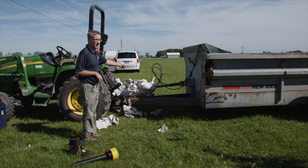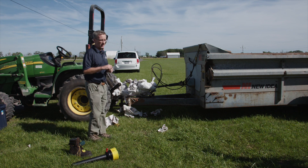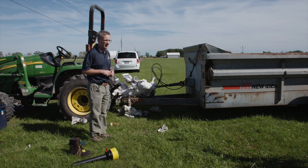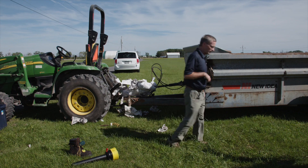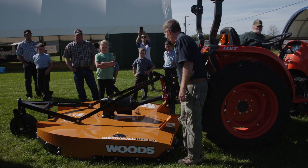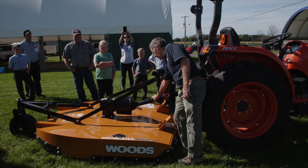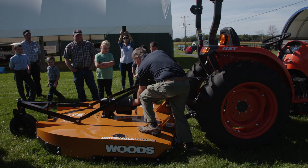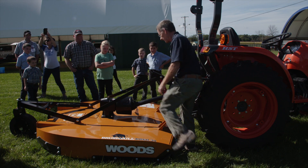This shield was totally missing, but I wanted the shaft exposed for this demonstration so we could wrap it up — otherwise if I tied the string to a plastic PTO shield, it would break it. On this other tractor behind us, the front half of the shaft isn't connected, but we can see the rear half of the shaft is properly guarded. I can spin that by hand so I know it's not frozen or stuck to the shaft, and I can't pull it back from the universal joint — so I know those bearings are in place and it's working.